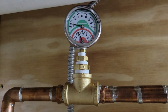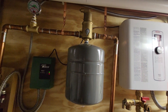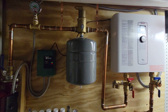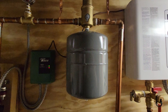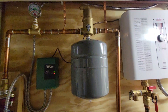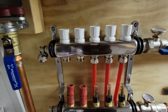I don't fully trust the gauge — the pressure reads about 15 to 20 PSI. I have a question: if I'm pushing water into the whole system and the expansion tank is set to start expanding at 15 PSI, then if I hit 15 PSI and keep pushing, the tank expands but the pressure would never go higher because the expansion tank absorbs it. So I don't know if it's truly 15 PSI or a bit higher, being lowered by the expansion tank. When it's warm or cold the pressure is usually around the same, so I don't think it's expanding much. If anyone knows or has a video explaining this, please let me know.